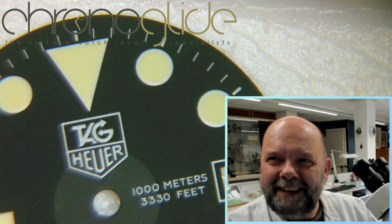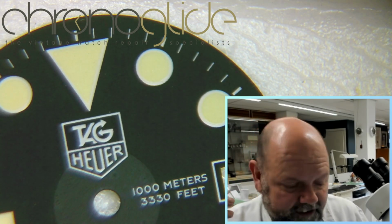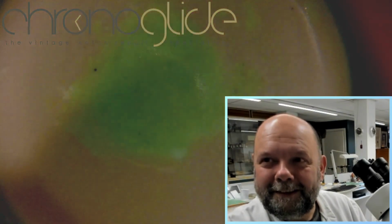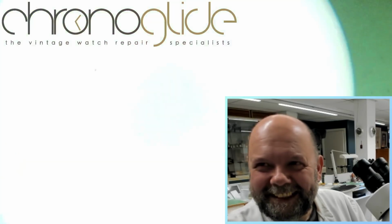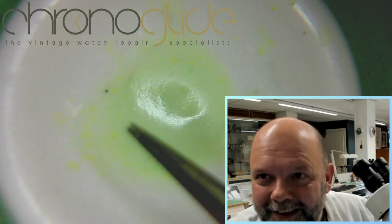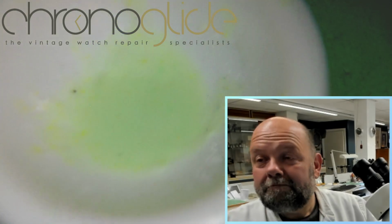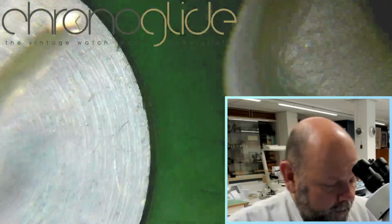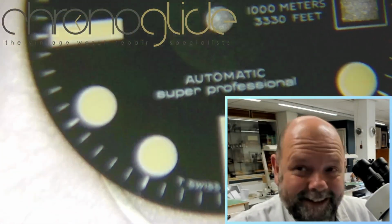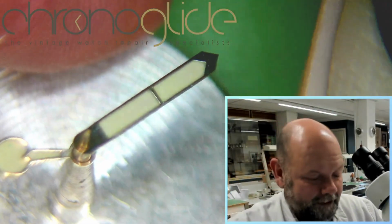these markers, do you see, it is greenish yellow, but the hands were completely black and horrible because of the rust inside the watch. So I made paste. Maybe I can show you here, luminous paste. And you can see even the yellow, and I used tiny specks of green in this paste. So what I did, I had a good look at the color of the dial. Luckily it was discolored. And the hands, I just tinted them to the original dial. Look at that.